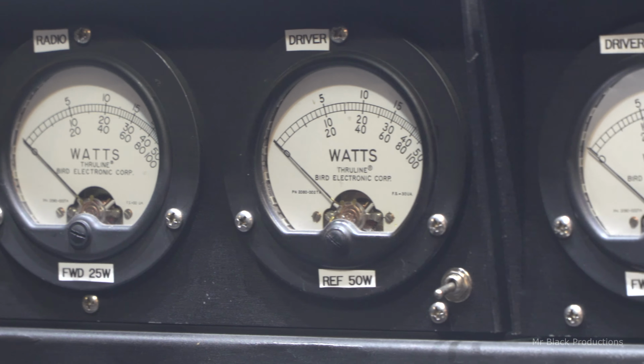I mean, they don't, unless you are running an 18-volt battery bank and running on a capacitance. See, a lot of guys will take a 12-volt and a 6-volt battery, tie them in series to get 18 volts, and then charge at 20. When they go to key, they'll use a very small alternator, like a 150-amp or 200-amp alternator, and they run on just the capacities of the battery.